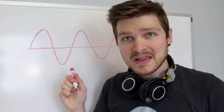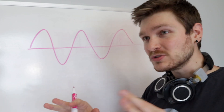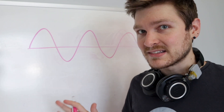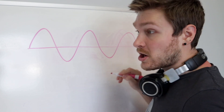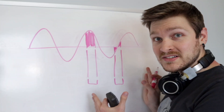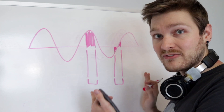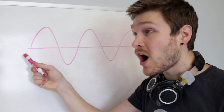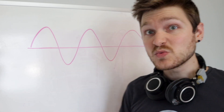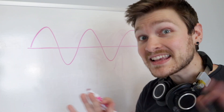So what's going on up here? Here's mains power. How do I make this less so that I can control the reflow oven really precisely and only turn it on a little bit to follow the temperature with a PID loop? I can chop this wave up and kind of PWM mains a little bit. Now if I just PWM it randomly and turn it on and off out of sync with the wave, I really don't know how much power is going to come out of it. These two filled-in sections can have the same width triggered from a PWM signal, but obviously they put out different amounts of power based on where I've caught the wave in its period. So instead, we can watch this wave and wait until we see the zero crossing points — this is when the voltage differential between the two mains lines equals zero, going from positive to negative.